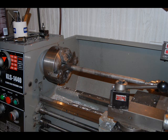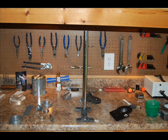In this photo you see the declination shaft set up in the lathe. It has been centered at the back with the saddle held in the chuck. I then centered the far end, used an end mill to cut a hole in the shaft, and now have the tail stock with a point holding it. I will clean it up without removing any material from the bearing surfaces—you can see the dark circle where the polar bearing in the back meets the declination shaft and rides on it.